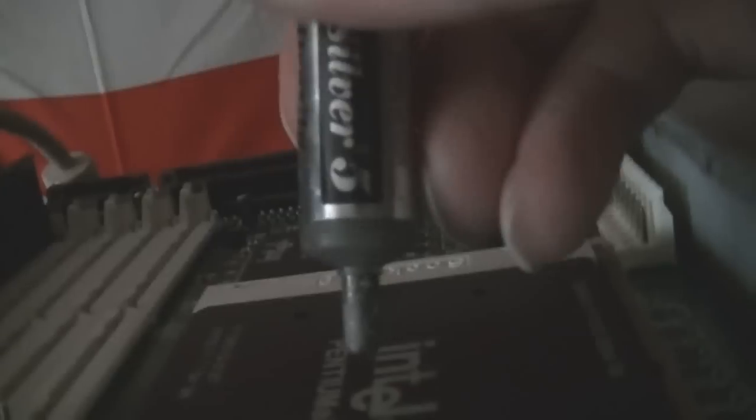This Q-spec number — I'm unclear on exactly what it's saying. I suspect it's a qualification sample due to the Q, as it lacks an ES marking, so it's likely identical or very nearly identical to the final chip you could buy off the shelf. This one would have been sent out to an OEM for them to evaluate the chip and make sure their kit could actually work with it properly, and whether it was worth ordering any. It also doesn't have a CS marking — customer sample — so who knows? Either way, it works, even if I did have to put some pins on it due to a previous owner breaking them off. Moron.